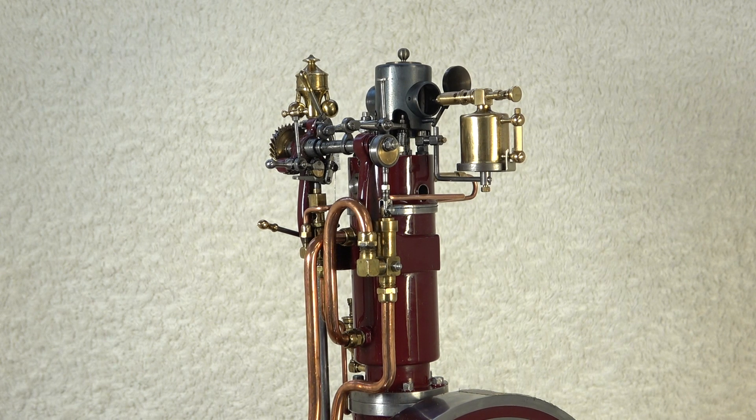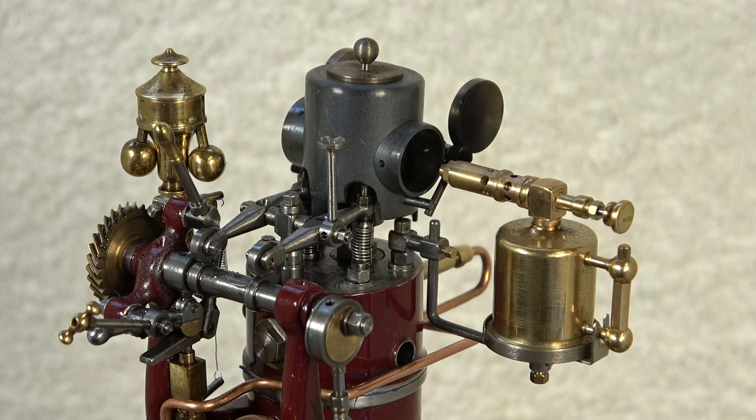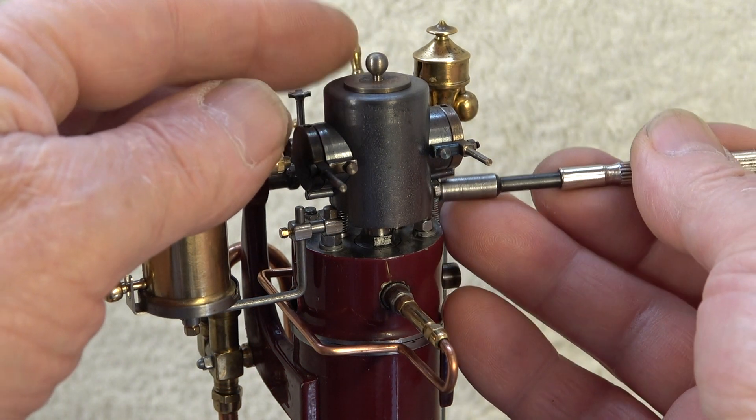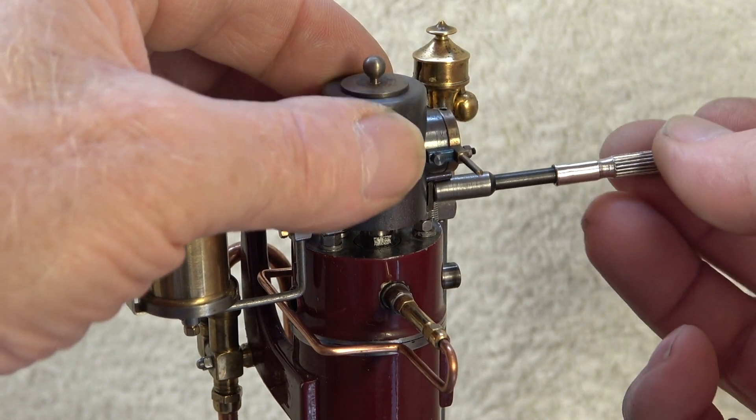So in this case, there is no reason for clamping the engine to the table. Let us have a look at the cylinder head to see the changes I have made for semi-diesel running. I will not go into details what I have done to the cylinder head, because I have another YouTube video showing a horizontal diesel converted from diesel to semi-diesel, and it is about the same that I have done to this cylinder head. I will put a link below. I will take off the hot bulb cover now for a better view.